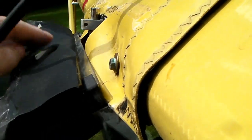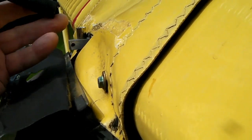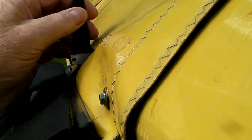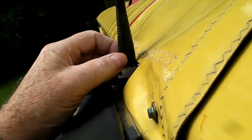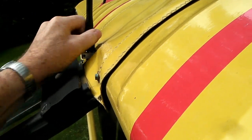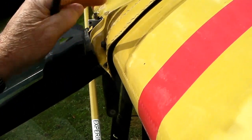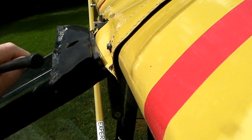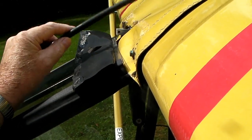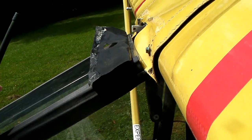After I pull back the sailcloth repair tape, I took off my radio antenna which is mounted over my head on an extension, and just used the rubber ducky antenna that came with the handheld radio. You just twist it and it comes off. Then there are two screws, one here and one over here, that I have to take out. That gets me to the controls — the flap electric solenoid, the motor actuator for the electric flaps, and most of the fuel system which you can see pretty easily from there.